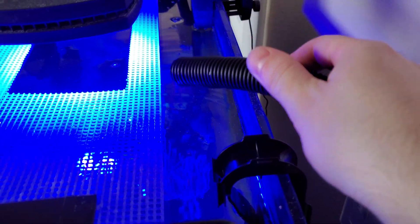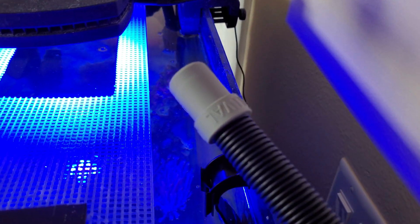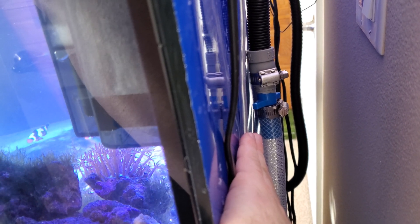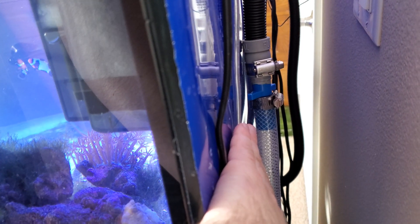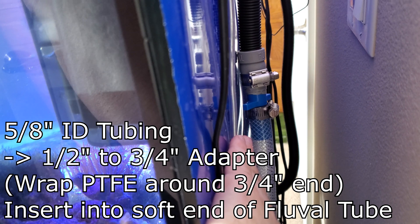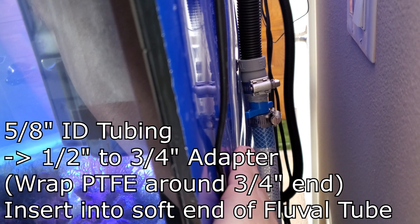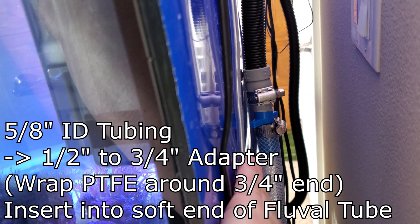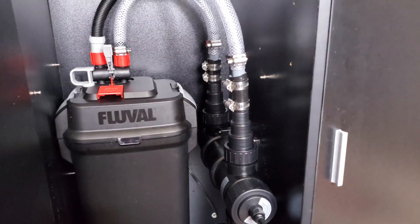We'll be making an adapter that will hopefully attach on there without any leaks. I put a different connector between those two — the threaded one just wasn't giving me as good of a seal as I wanted. So we ended up going with a half-to-3/4 fitting, and I wrapped the 3/4 with some PTFE tape to give it more of a soft-on-soft seal with the silicone edge. Things are looking great — not a single drop so far.